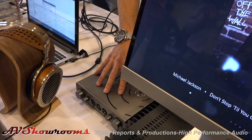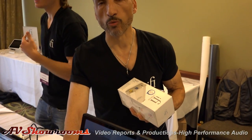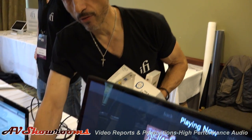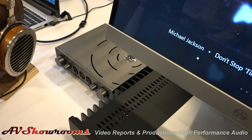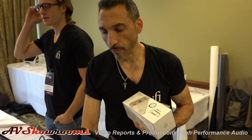This is a full-function, fully symmetrically balanced, tubed line stage as well as headphone amp that has switchable output between solid-state, hybrid tube, and full single-ended tube triode output, with enough gain to drive any can, to include ESLs, and a balanced line section along with the 3D holographic technology they've developed for all their other products.